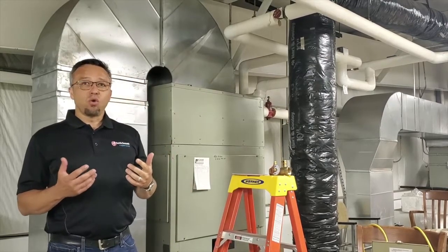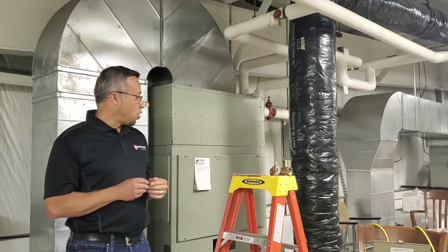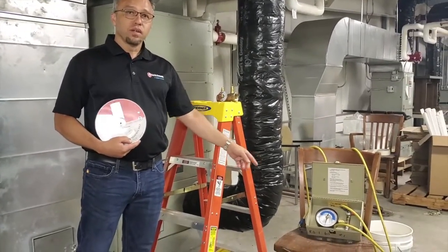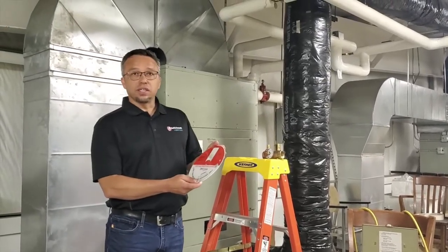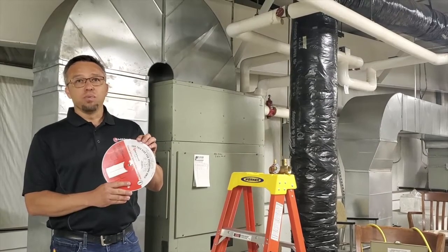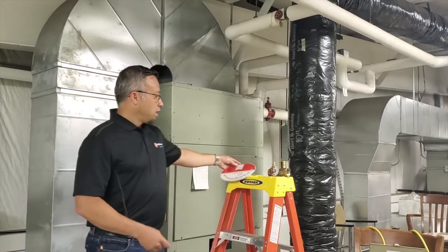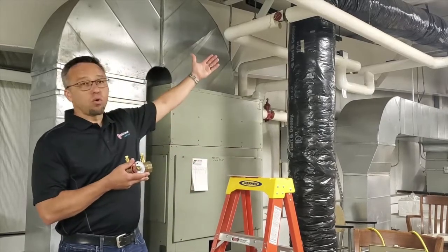According to the blueprints, the coil was supposed to be set for 11 GPM. We are going to use a Bell and Gossett R01 readout meter along with the Bell and Gossett circuit setter balance calculator. Side one on this unit will be for presetting circuit setters. Side two is the side we'll be using for taking readings across the valve. Today's example is using an inch and a quarter circuit setter.